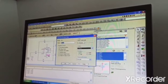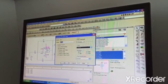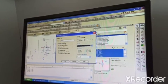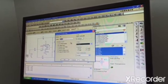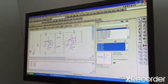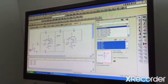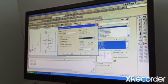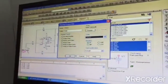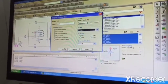So now resistor values are given. Now voltages we have to give — we want to keep 12V DC. 12V DC. Now this amplitude is going to be offset — no offset voltage, it is going to be 0. Your amplitude is going to be 100mV. This frequency we can keep it as 500Hz. This AC is going to be 230V.